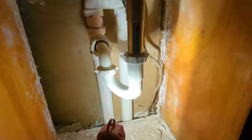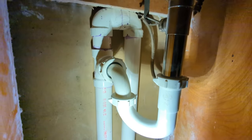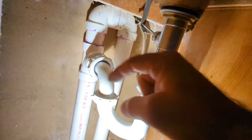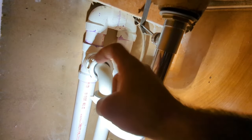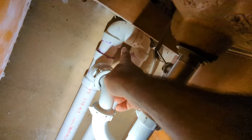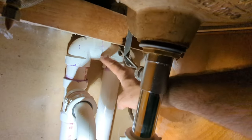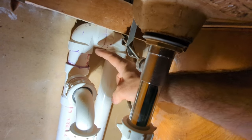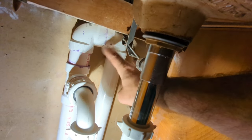And then over here, like I said, I asked him, and he said, yeah, rather than just having the elbow that was here, gotta have the sanitary tee and chase the fluids down with atmospheric pressure. So you may have noticed around here I didn't go with a lot of vent elbows. Those are the elbows where the hubs touch right here. There's no exposed bend. Those are for venting only. They shouldn't have fluid flowing.